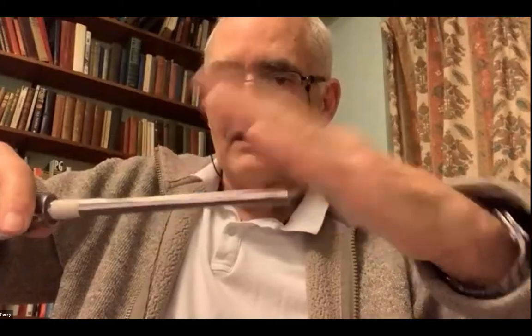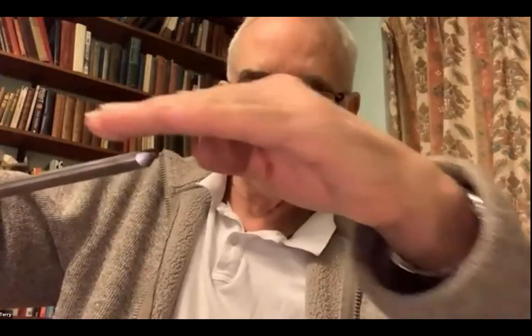Now the spindle gouge, on a bowl gouge, no, I beg your pardon, on a spindle gouge, I'll talk about having a sweep angle, by which I mean the angle, can you see which way up that is? Can you see that? Yep. That's the bevel angle. That is the sweep angle. And on this one, the sweep angle is pretty shallow that way. Having a sweep angle like that and having the tool more pointy, not with a point, but more pointy, if you know what I mean, lets you cut deeper coves.